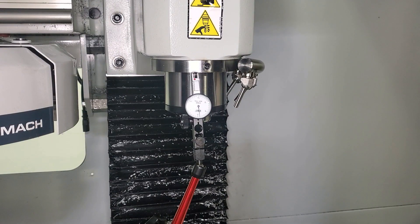Not being back at zero shows us how much backlash we have. In this case, since this is a half-thousandth resolution indicator and we have two tick marks, we're showing one thousandth of backlash. That's actually a fairly decent number — I could tighten those bearings a little bit more, but for one thousandth I'm going to leave the bearings where they are and comp that out with backlash compensation. Since I like this number, I still need to go back to our bearings and fold over that tab into our top bearing nut, then put our cover back on and we'll be good to go.